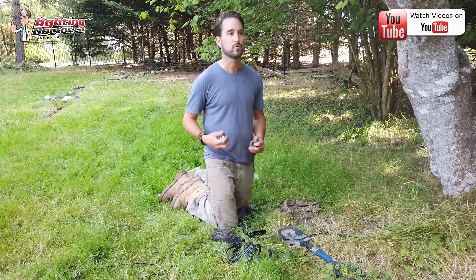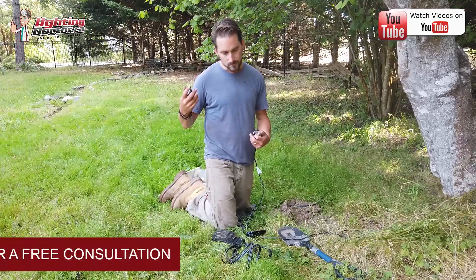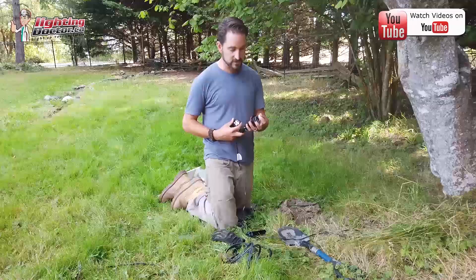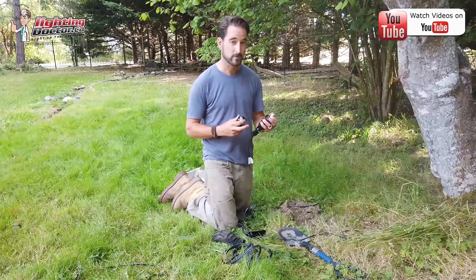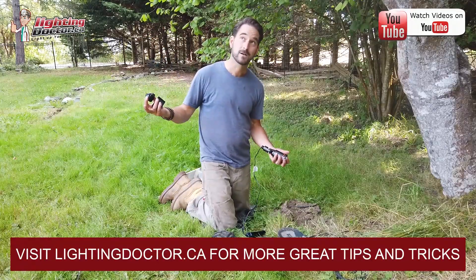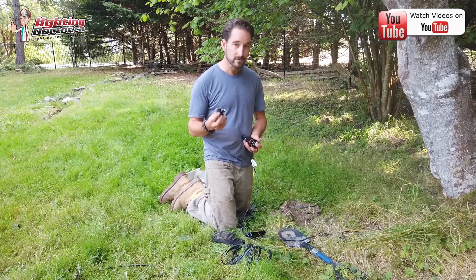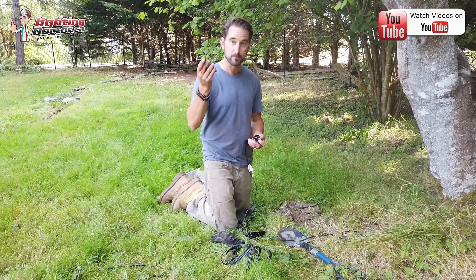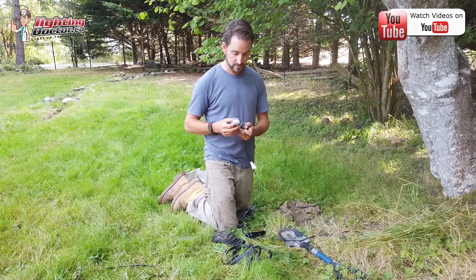If you're doing a very small system that's fine, but if you're getting upwards of 15 to 20 lights plus and still going with cheaper models, there's a good chance you're going to have some problems. Another reason I like this fixture is the components are really easy — I'll talk about some troubleshooting stuff later. On this property we've got some trees I'd say are 80 to 100 feet high, so I want something bright enough. I love the ability to just switch out a bulb — if it's too bright or not bright enough, I don't have to change the fixture or mess with the LED board; I can just pop in a new bulb and try something a little brighter.